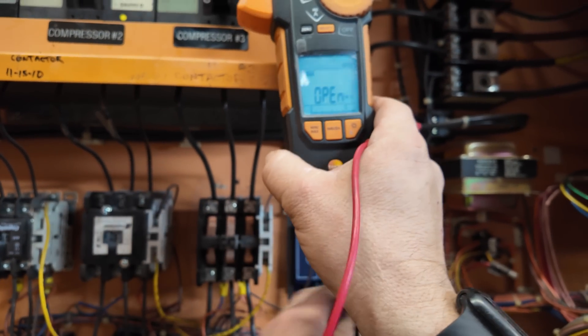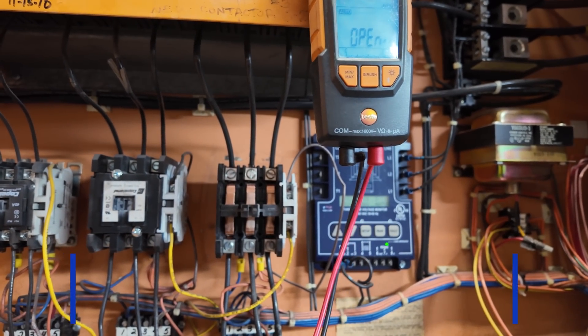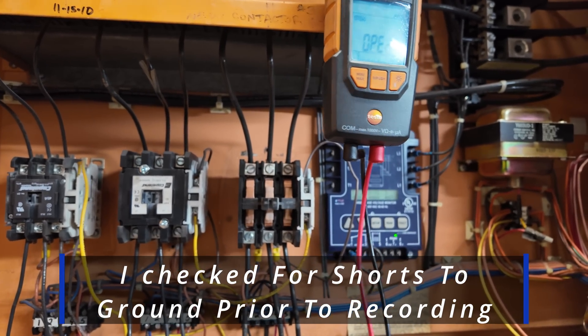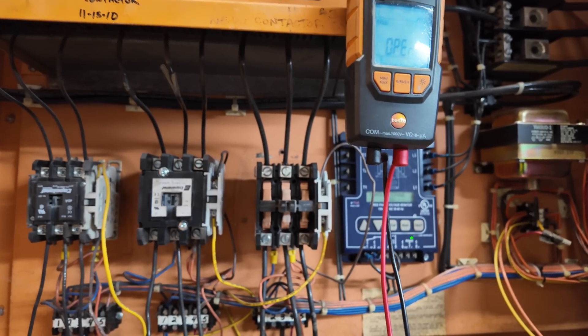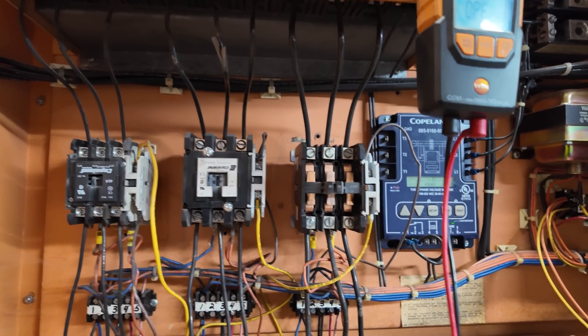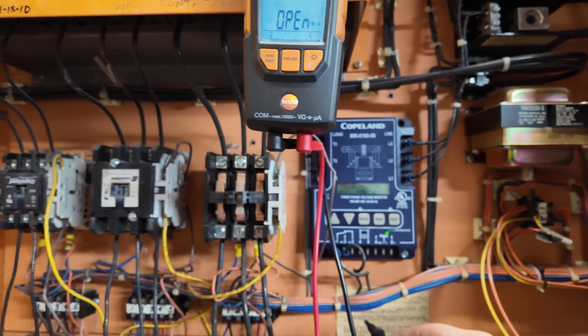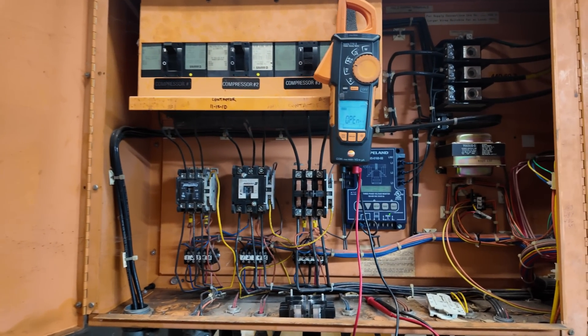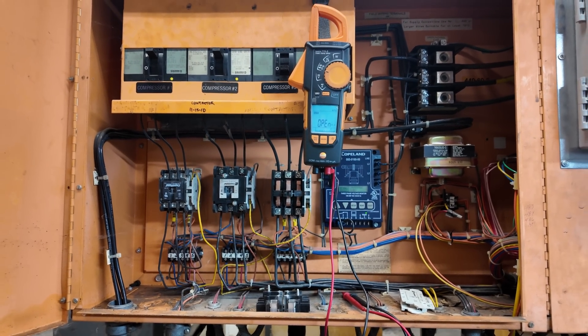So I'm not thinking that we're shorted to ground. When you get up to the higher voltage, the three-phase, the resistance is really low — that's not very uncommon. So I wanted to make sure I checked for any shorts to ground before I just flipped on the breaker. It being 480V can be a little scary because you can have an arc flash — you want to make sure that you don't have that.